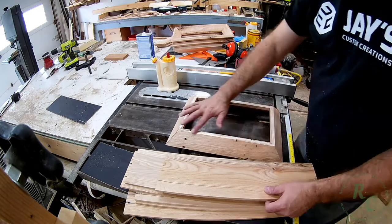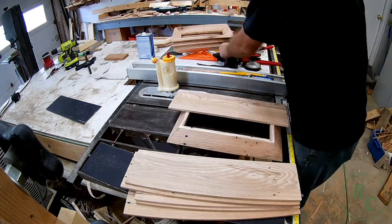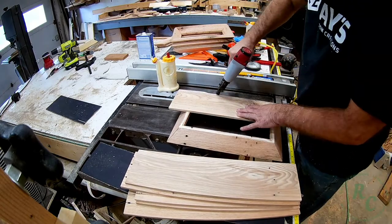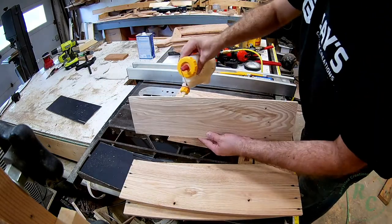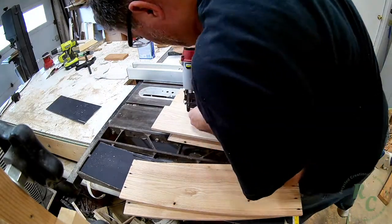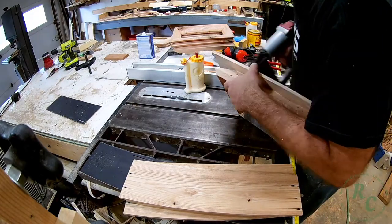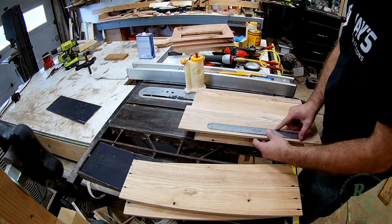For the bottoms I just take some pallet wood and pass it through the planer a few times on both sides to make sure it's good and clean, then glue and tack it in place with some 18-gauge brads. I went just a little overboard on the brads — you really don't need that many, and it's probably just going to dull my table saw blade in the next step or two.